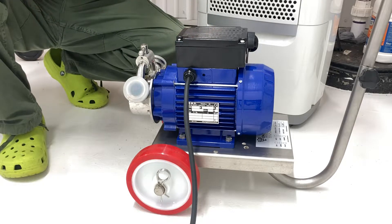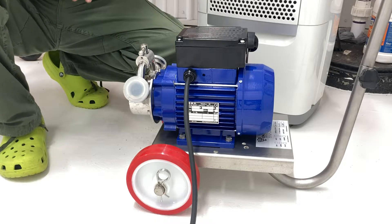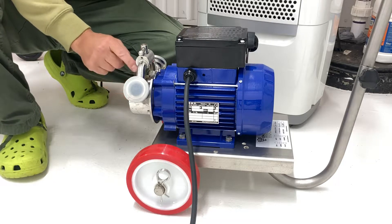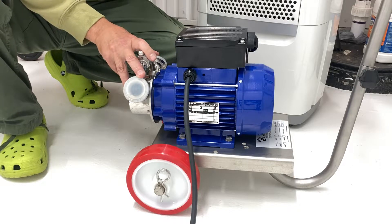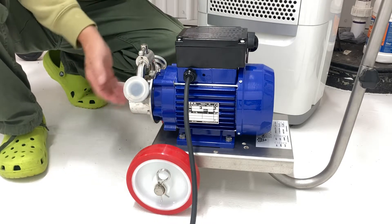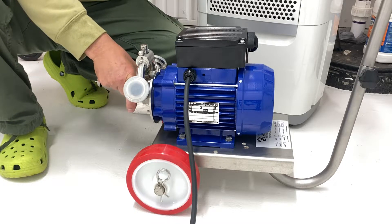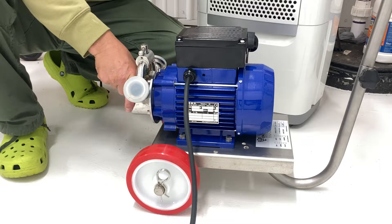It does almost 20 gallons per minute. It is fabulous for me, but better yet, it has a flexible impeller and it is self-priming. You need to make sure you have moisture in the head before you turn it on, but it will draw suction and it has that moisture to work against, keeping the rubber impeller from getting hot. It did a great job moving from 15-gallon containers into my barrel.